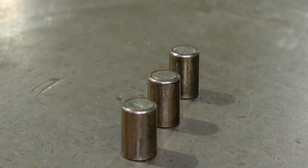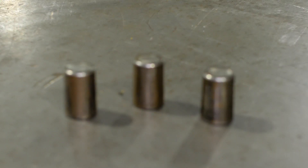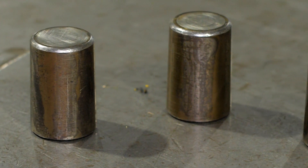And how will that affect bearing performance and bearing life? Well, if you don't clean this up periodically, repair it, take it out for maintenance — this can turn into a fatigue spall or even worse.